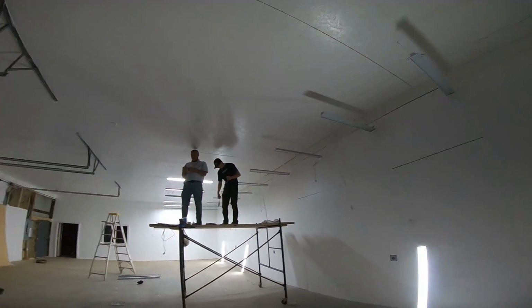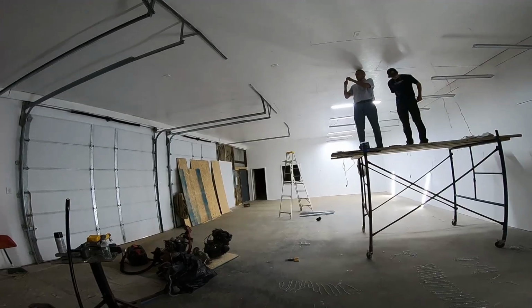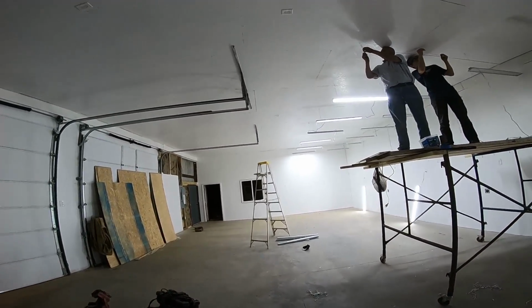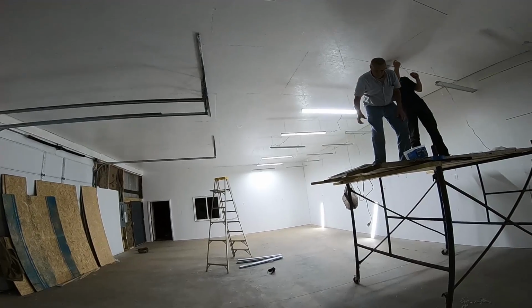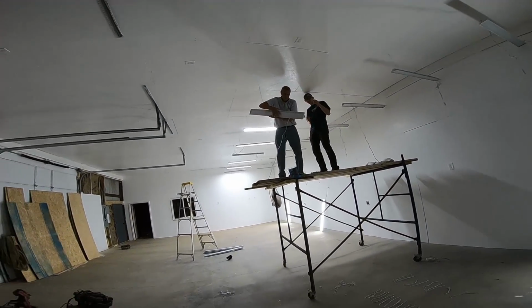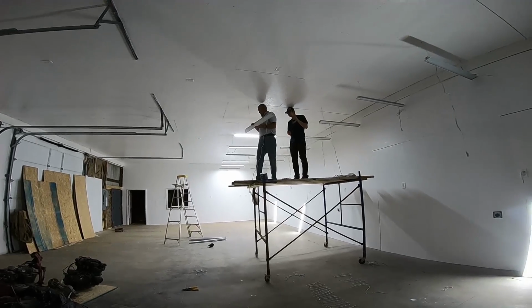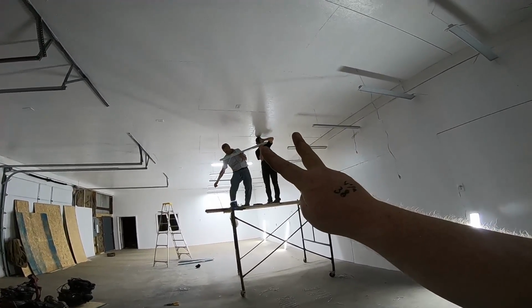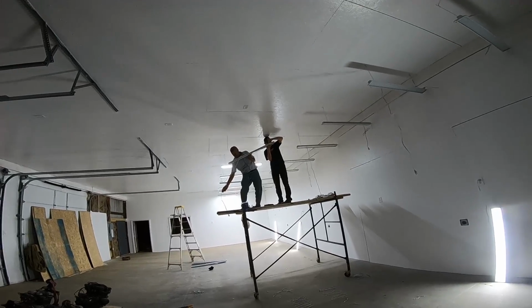These lights run 0.33 amps per light. We have basically 30 of them per 20 amp breaker, so that should be around 10 amps or so is what the math adds up to. So looking good, looking good. Me and Egg are tag teaming, swapping out, and then wire on your side, Ed. Yep, so we've got to flip which side the plug is on each run.